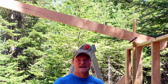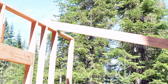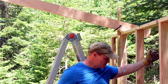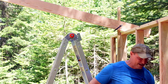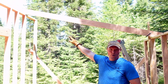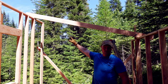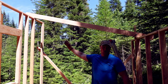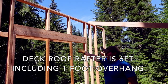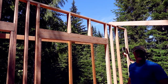Right now I've got to find my spots to notch my rafter for the bird's mouth here and up here. I want to give myself enough excess to shed snow off the back end on the down slope, so water, snow, and ice doesn't come back, curl in, and hit the side of the cabin. Plus I've got to give myself a little excess up here for a lobe on the front end of the forward wall, to nail in my roof rafter for the deck roof — which is a short little run, just around five feet — and then that board will run across to that ledger. So right now we're going to do our calculations, get our pencil lines drawn, and start cutting.